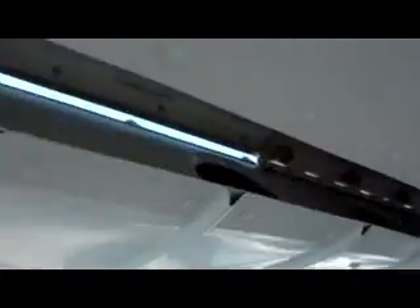The weights on the right aileron are in good place. The hinges are fine, the surface is fine, and it moves well.